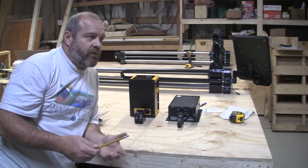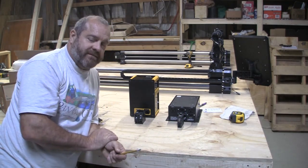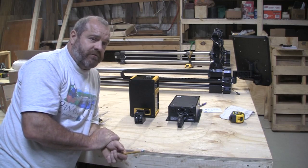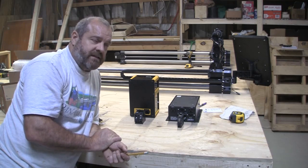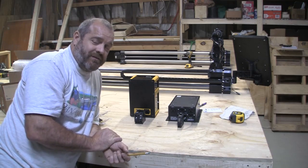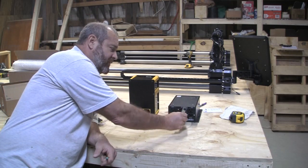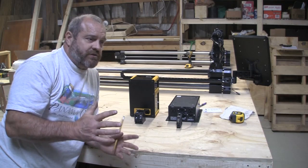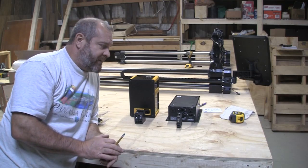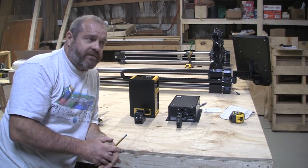Now, the way electrical works, it's not a different outlet, because you could have up to 9, 10, 12 outlets. If you're running 20 amp, 12-2 gauge wire, you could probably put up to 12 outlets on it. For residential, there's no code for how many outlets you can really put on. Commercial is a whole different story. So be aware of that. You might be needing to run that to another outlet. If you're having, you know, surge issues or whatever, something weird going wrong, that might be the problem. A lot of people on the threads, on Facebook and whatever, they all say it's EMI.